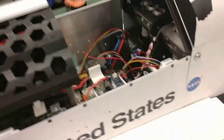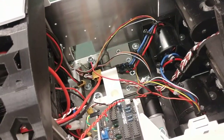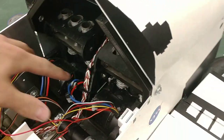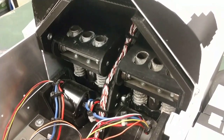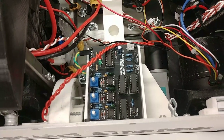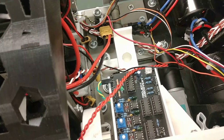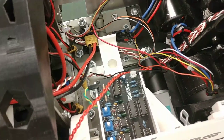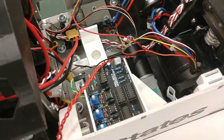Back here in the back is where battery management, rear drivetrain, and wing lift motors are stored. The VESC is not currently installed as I'm working on remaking the case for it. These motors are the main drive motors mentioned earlier, and all of these parts are the rear suspension that allows the shuttle to go over uneven surfaces. This custom-designed PCB takes in two limit switch inputs as well as an up and down toggle input, and it frees up pins on the microcontroller so they can be used for other things.